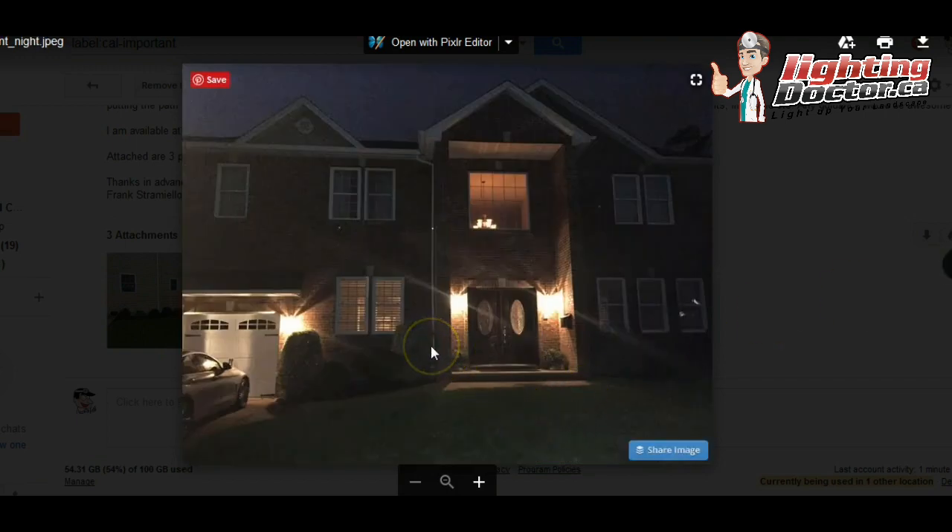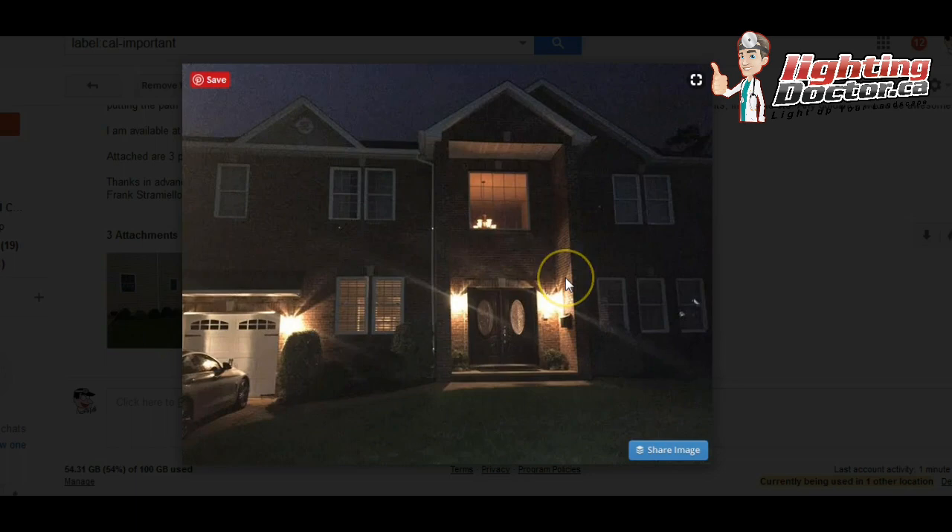Moving around to the front here — because you guys have some of this lighting already — what I would probably do is use a standard up and accent light. The way I would balance it is I would try and get on both sides of these pillars, not necessarily up the pillars because I think you have concrete there and that'd be tough to do, but on the inside by the window here, highlighting really up to the top as far as you can. I think with the standard 35-degree bulb that comes with most of our accent lights, it'll easily get to that height because you don't have a lot of branches to compete with. The light will easily get up there. And then I would probably have another up light and accent light here that kind of highlights up in this area as well.